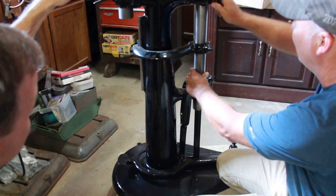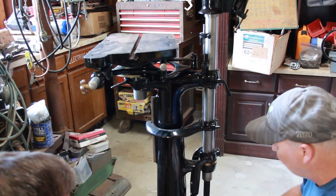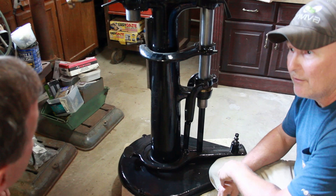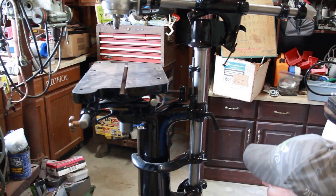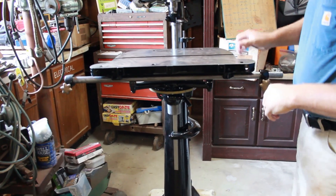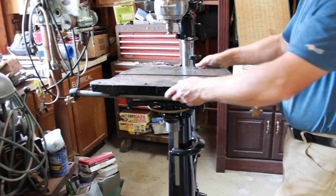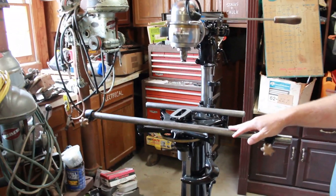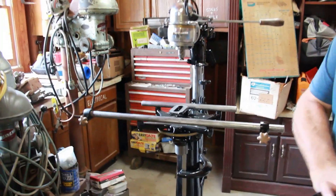All these have to be loose and then the pedal should activate. There's a long spring in here, about four feet long — it goes up in here and this activates on that spring. When I got it there was an extra short spring in there, and I'm thinking I'll have to put that back in to get it to activate correctly. I could push it but it won't return. I have to do some adjustment. The long spring doesn't show any evidence that it broke — it looks original length. I soaked it in Vapor Rust to clean it and repaint it, and I just cleaned up and put it back in. For the metal spare parts, I soaked all the pipes in Vapor Rust to get the surface rust off, then cleaned them up and put a dry film on them so I can go back later and polish them correctly.